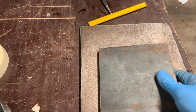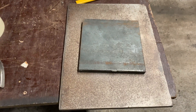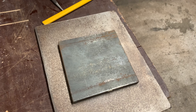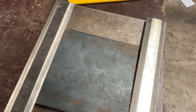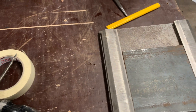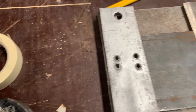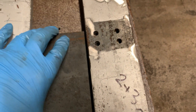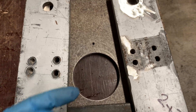This is upside down effectively, but that's what I want to do — there's a plate of metal there. We'll be able to pull that out, expose the hole, and push the briquette through. I've already cut these on the last video — a couple of plates either side. These plates will go on the top like that, bolted on with some big bolts going through, because there's going to be a lot of pressure. You'll be able to slide this out, exposing the hole — you hit the air on the ram, the ram will push the briquette through.